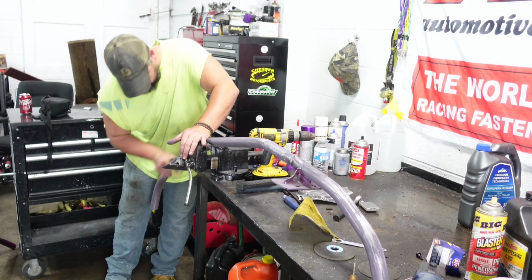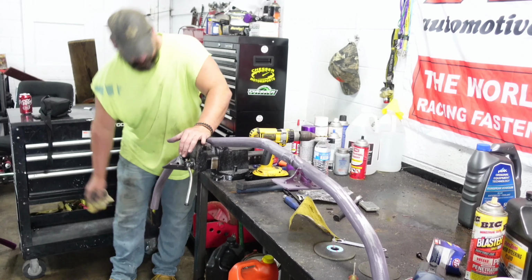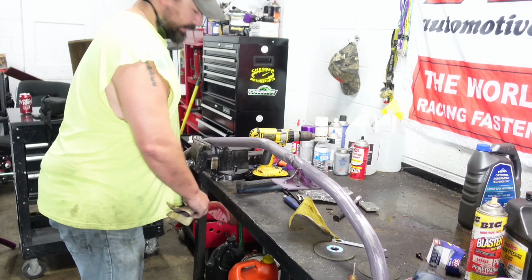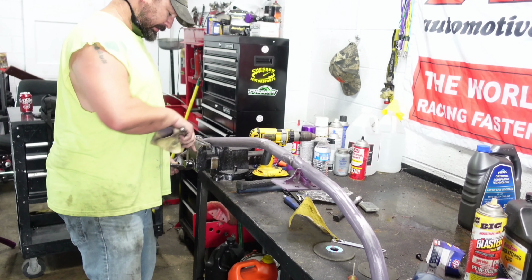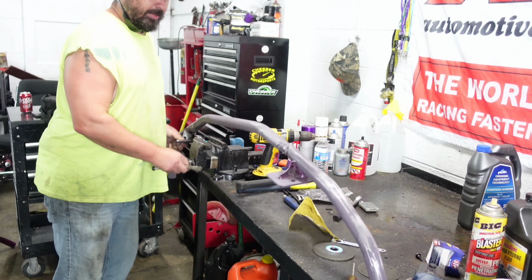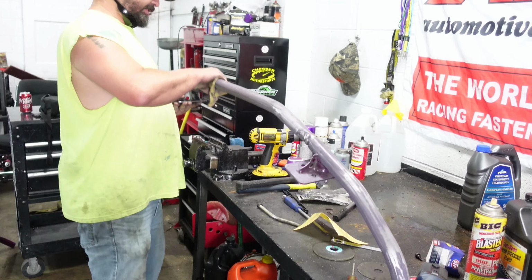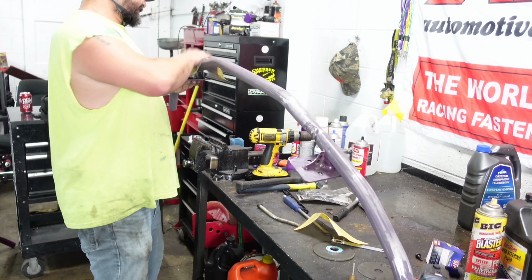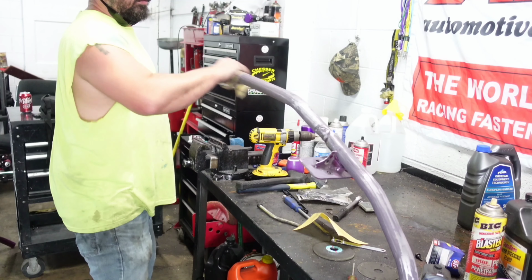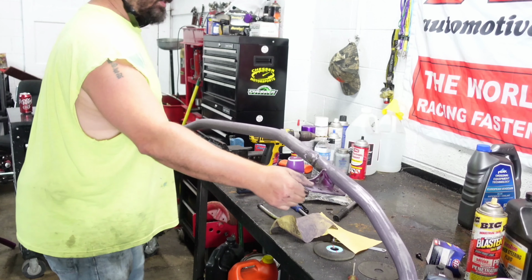Wipe it down. If I got some alcohol or something, wipe it down, and that'll get our dust off, that'll get our fingerprints, and that'll make it where the paint won't run into any oil off my skin, or it'll clean any dust off. That'll keep it from sticking to the actual metal. About ready for a coat of paint. Let me see if we got some alcohol to put on it.